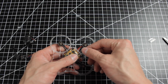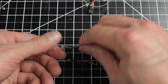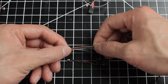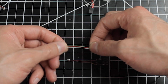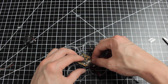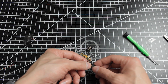Bend the capacitor up a little bit so it's not running into your props. For the receiver I'm using the Nano RX. I have mine soldered with the older wiring harness, but they now sell a new one through Newbee Drone with slightly different colors. Looking at the top: white is the bottom pin, black is next, red is third, and the green wire is last. Since I already have mine soldered on the old harness I'm just going to use that. Let's get it plugged in and give the Nano RX wires a little twist to clean things up, then plug in the antenna.